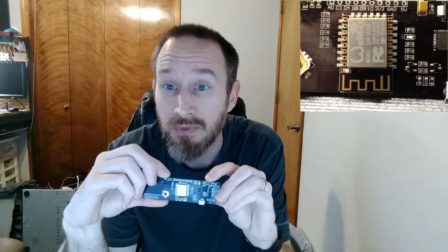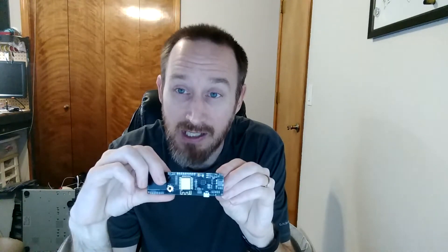There is an on/off switch in the corner. The 18650 can be charged, but it cannot be running and charged at the same time, as far as my understanding of this device. This device is set up, as are a lot of similar ones I've found, to take a flat-top 18650. If you try to use one that has the little knob on the positive end, it does not fit in there well. One of the other problems I've noticed is that once you put the battery in, it becomes very difficult to get back out. Also be aware: there is no reverse polarity protection. Plug the battery in wrong and you're going to fry things. So I went ahead and put positive and negative marks on mine just to make sure I didn't fry the device.